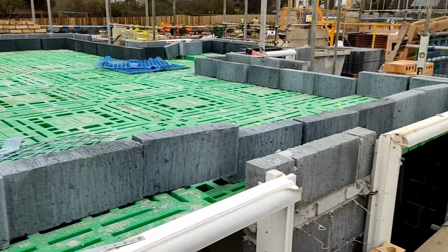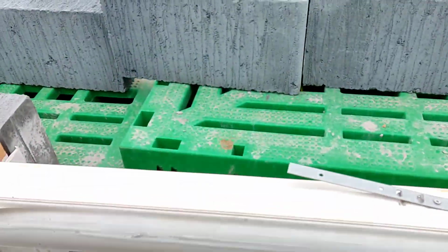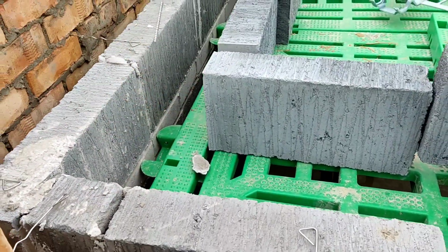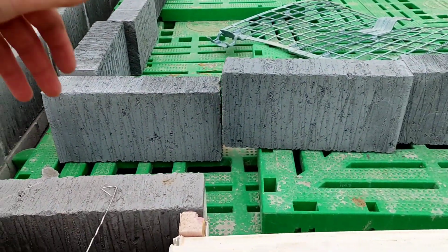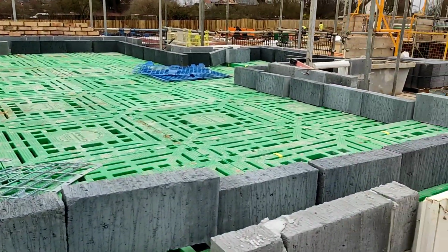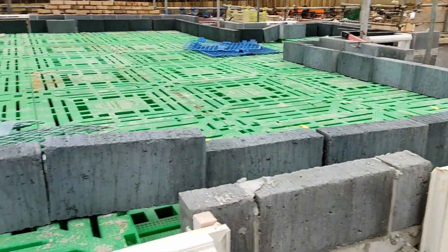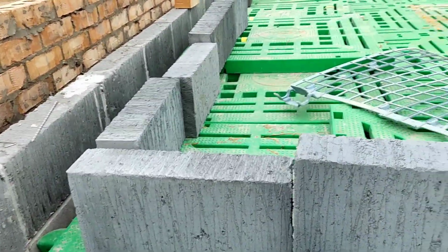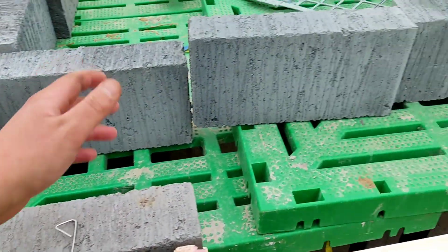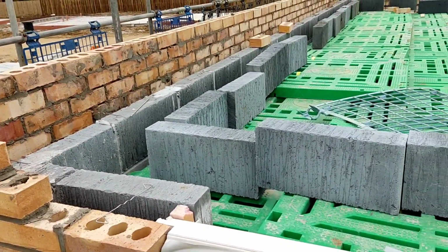So, I loaded all the blocks on the inside. Lay them overhand with the line on this side for one course. Obviously plumbed on the opposite side, I don't know. Or I can always jump in and do that. But I don't like bending, so I might just overhand it. You know, stand on the crate if I must. But if this arris is flush, that should be pretty close, considering there's only joists going on it. Nice height, to be fair.